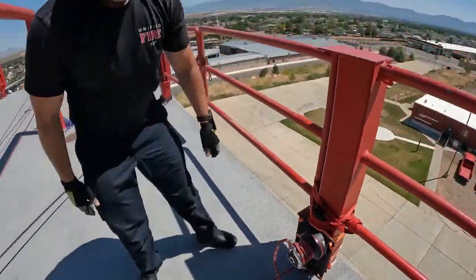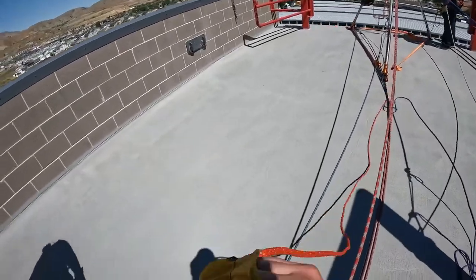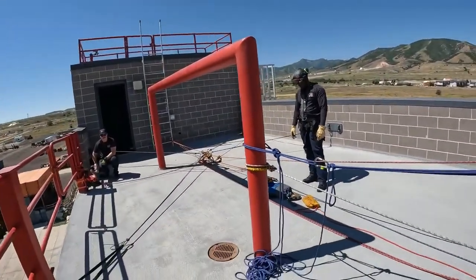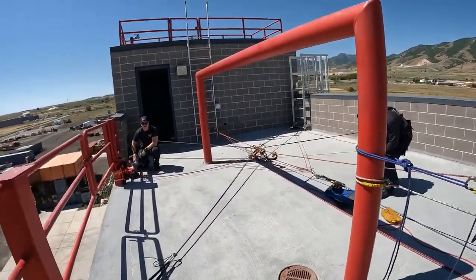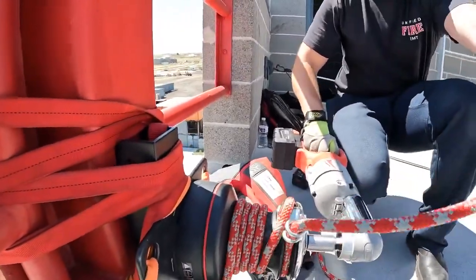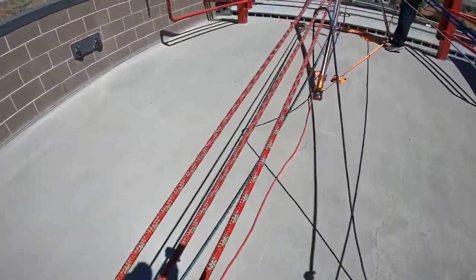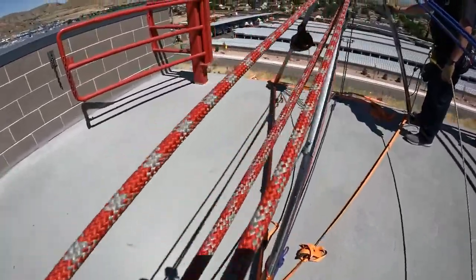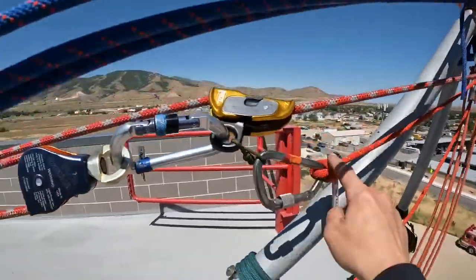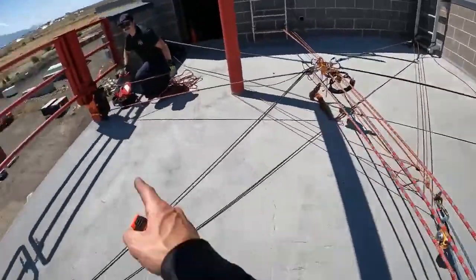That looks good. Main is ready. Ready? Ready. Main ready. Belay ready? Belay ready. The belay is going to be not only belaying, but also resetting our remote reset rig when we two-block on the three-to-one on that throw. Edge ready? Edge ready. Safety's ready. So we're hauling up — there we go. There are two modes, fast and slow. It tends itself a little bit. Now this is our first throw. Let's follow our three-to-one back up. Okay, now we can see how we're grabbing. Now you can see that remote reset rig right here, tracking through a pulley just like that. Good operation on the winch.